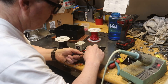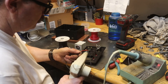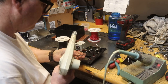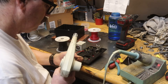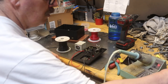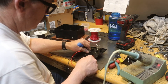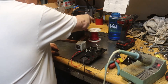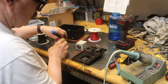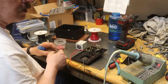This is just rough wiring — I haven't sized it. I'll wait until everything gets together and then I'll size it. I'm going to make some extensions using crimp connectors because these are lug-type connections. I'm using red for neutral instead of white just because I don't have any white wire of the right gauge. You can use any color you want as long as you keep it straight.